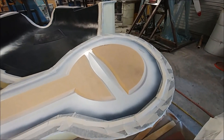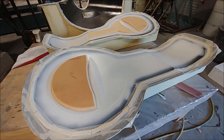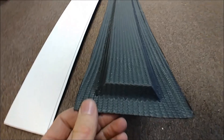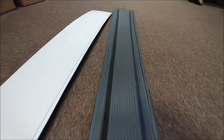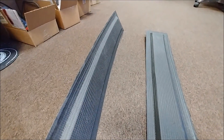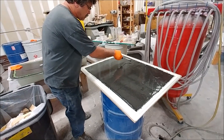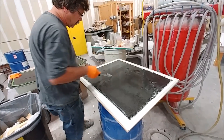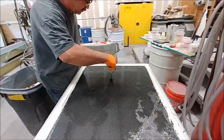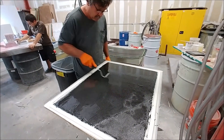Here's the nose gear door — Jeff already did those on Monday and they've just been rough-trimmed. That's basically what they look like with a bit of core in there. Ultimately they'll have hinges so they can open and close. We also need a little more flat stock to create backing plates for the rear pressure bulkhead doors that need to be fastened in, so Jeff's laying up some flat stock for that.